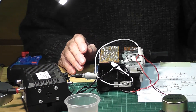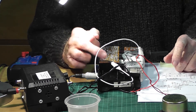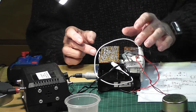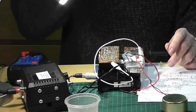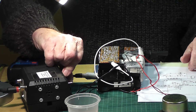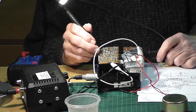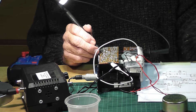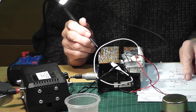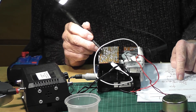Back again. I had a little delay because I was doing some voltage checks on the transistors and realised that even the ground line was measuring 6.5 volts. I quickly realised it needed grounding - when you take the screw out that holds the PCB onto the base you actually isolate it from ground. So everything was floating at about 6 volts. With a ground lead connected, my little amplifier is now giving some results. Going to the volume control I'm actually getting some sound. But if I go beyond it there's absolutely nothing on the base of the output transistors at all.